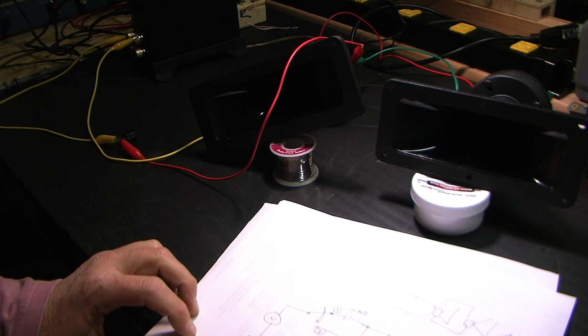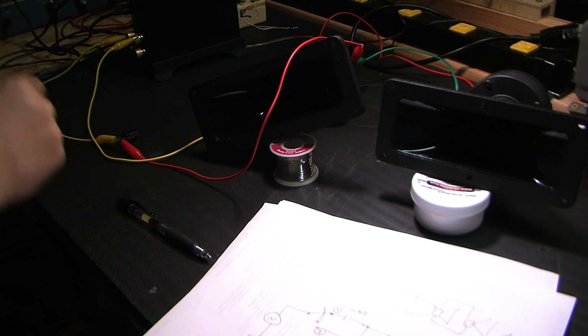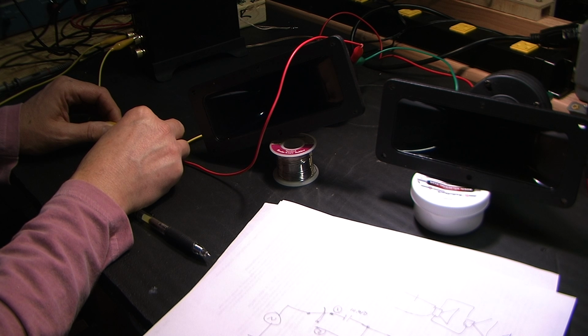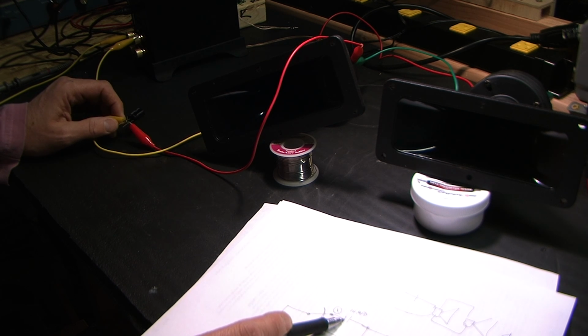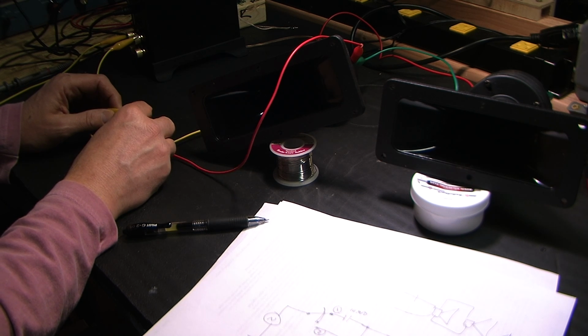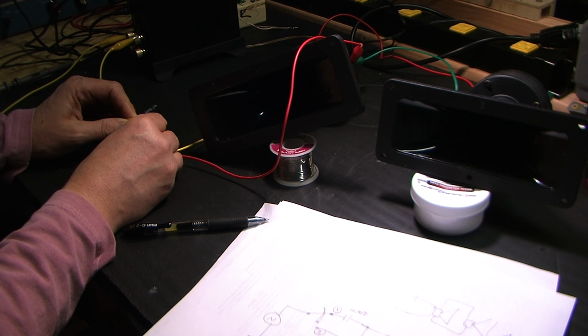Let's go down to 4K, which is the crossover frequency, and do the same thing. Now we should notice the level drop about in half. I mean, increase by double. That's what I mean. So at position 1, this capacitor is actually attenuating. In position 2, we'll get the full output. So here's position 1. Get ready for 2. It does almost double. 1, 2.